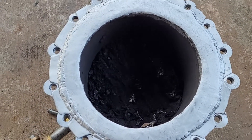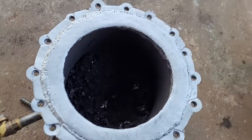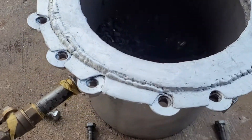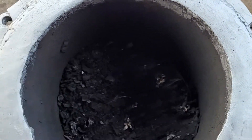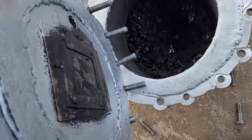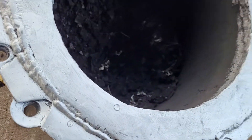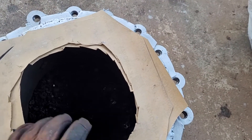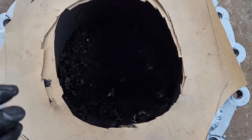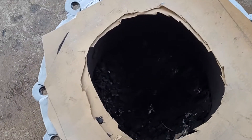Here are the fruits of my labor. You can't really see a big difference from the last version - it's the same reactor but upgraded - but there's now a ring around it welded from the inside and the outside. This ring acts as a spacer, and there's an equivalent ring on the lid as well. This allows me to use a gasket that can actually resist gasoline, high temperatures, and oils, because previously there was too much dead space between the lid and the body for a thin automotive gasket to work.